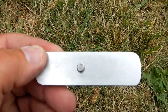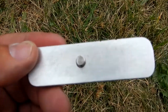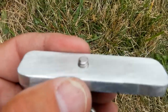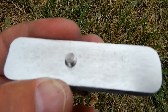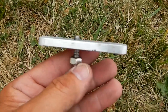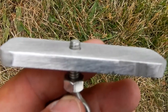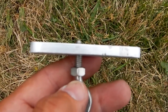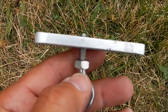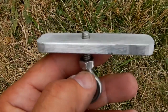The plate had its corners rounded. I used the sanding block to sand it up and get it kind of rough. The surface we're going to glue to the camera, I'll use a little rougher sandpaper to get it a bit rougher. What I'm going to do is use a two-part epoxy mix, and I want the bolt head sticking out a little bit so that when I put this underneath the camera into the damaged quarter-20 hole, that's going to locate it so that when it dries, the plate will be centered on the camera. I did a dry fit here and it works perfect.